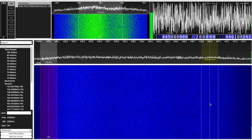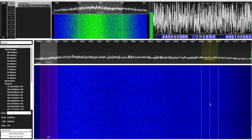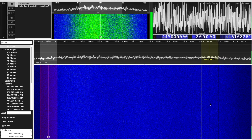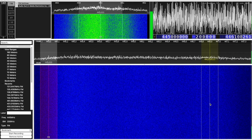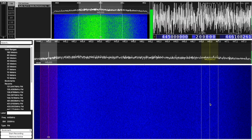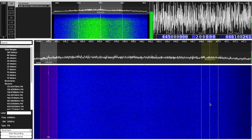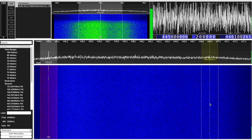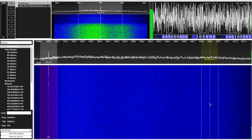The antenna has some directivity. What I'm about to explain isn't accurate or scientific by any means, but it does give you relative performance. What I did was hook an RTL-SDR dongle to my system, set it to non-automatic gain, turned the gain down to zero, and did not hook an antenna to it — so it's just sitting with no antenna in my enclosed office. Ideally, if you wanted to be more accurate, you'd do this outside.